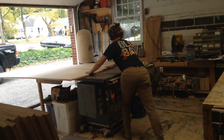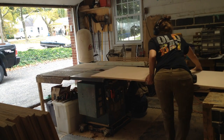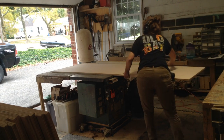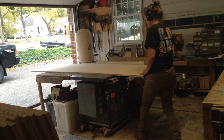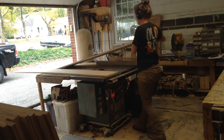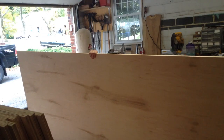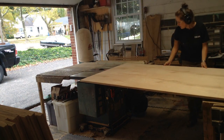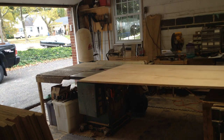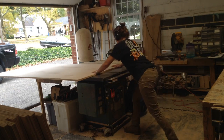As I start all these built-ins I'm going to be cutting down sheet goods. These are very specific measurements and I actually lost a little bit of the beginning of the footage showing how I make the base. There's very thick molding in this room — about seven and a half inches for the baseboard. I took two-by-tens and cut them down to make the base, framing it out similar to how you would a wall, and all of these cabinets are going to sit on top of that base.